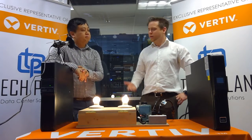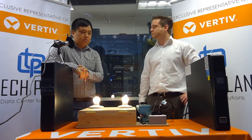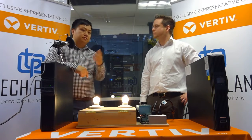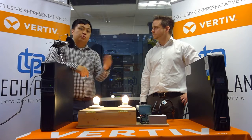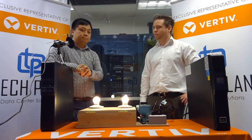When and why would you have a UPS in an electrical environment? You're trying to protect against any power outages, sags, or surges within the electrical system. A lot of times you may have a power outage during a weather event, but you also have flickering of the lights, a switch upstream — there could be an ATS at your building or it could even be utility switching.